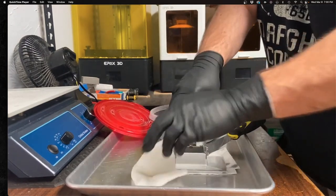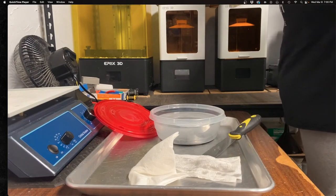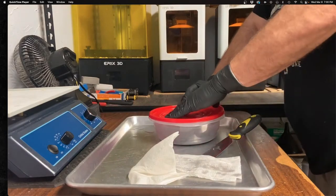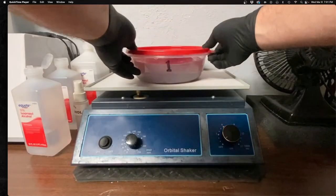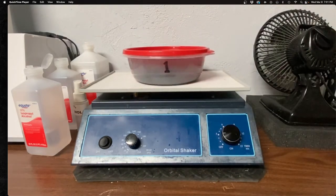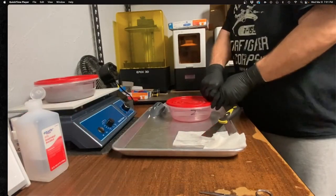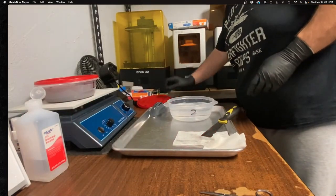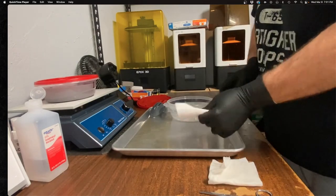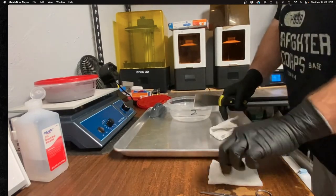But I kind of like this three-stage rinsing process, because I've seen reports of problems that Privateer Press had when they moved to printing initially from the casting and so forth. And then third-party printers, there have been reports that people have gotten uncured prints and so forth. And it's like, well, I don't want to send out any uncured prints. I want to make sure that all of the raw resin and stuff is off of them.